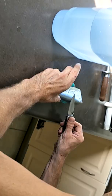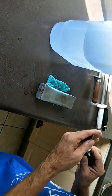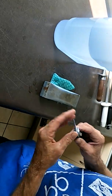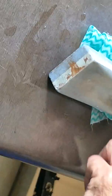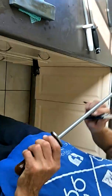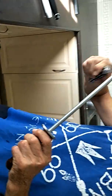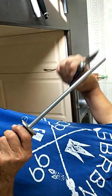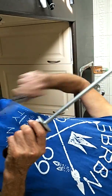So what are you doing now? I'm basically taking any ridges out of the metal that we put on there from downstairs. That's a stone — it's got a coarse side and a fine side, and you can see they wear down pretty quickly. And now I'm just going to put it over the steel just to give it a finish. You can hear it. And as I go, I'm getting more of an angle on it.